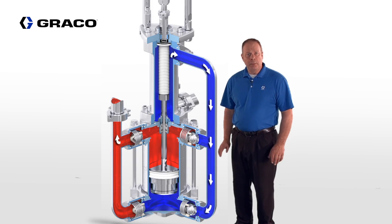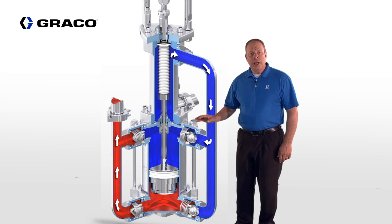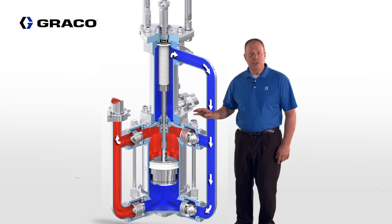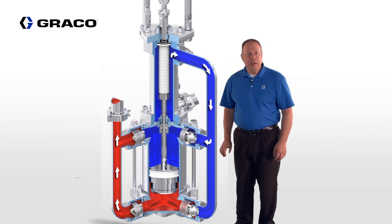Things that are unique about this pump: horizontal spring-loaded checks. These checks are loaded into a cartridge and can easily be removed for service by removing two bolts and sliding the cartridge out.